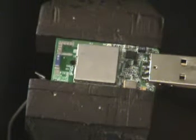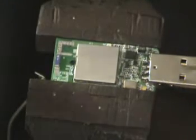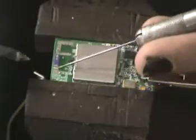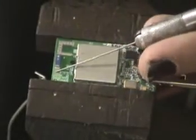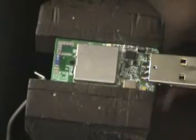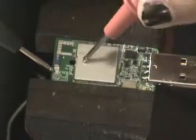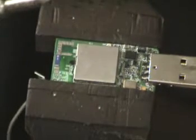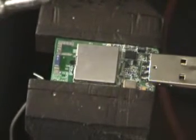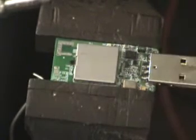So if you wanted to take that off, you would take your soldering iron. Now I'm going to try to do this on frame, but this is very difficult. You would heat up one side. I would recommend heating up this pad over here, which is actually tied to nothing — absolutely nowhere, not it. We take our continuity tester — nothing. Not hooked to shield, not hooked to ground. So that pad is just there to hold that component in place. We're going to take our soldering iron, take our pick, just heat this up — and boom, it's gone. It was that easy.